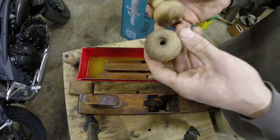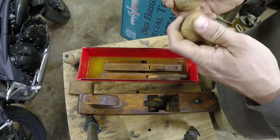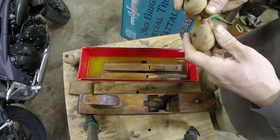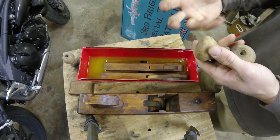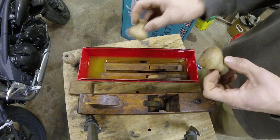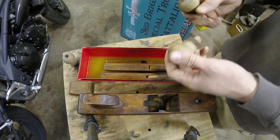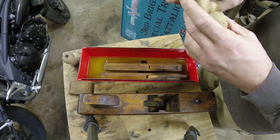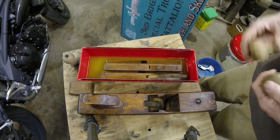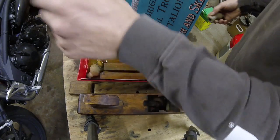I'm pretty happy with how the knobs look. I don't know what kind of wood this is — Stanley typically used rosewood but not on every plane. I know boiled linseed oil typically darkens rosewood, and an oil finish by itself I've had bad luck with; it just soaks up grit and grime from my hands and turns the knobs dark and dingy. These seem pretty pale to begin with, so I'm going to soak them in the mixture and then coat them in shellac. Some people dip them in polyurethane and they come out fantastic, but I have a bunch of shellac so I'll use that.